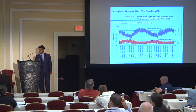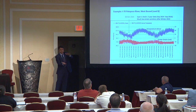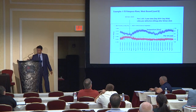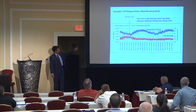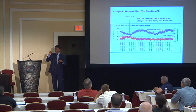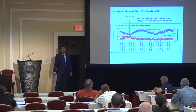Similarly, this graph shows strain — we see a lot of strain variation before that winter, and then strain started to subside, showing much less variation. And this is the pier: before that winter, the pier was deflecting back and forth thermally. After that winter, we see a pier that is quite flat. We still see those spikes caused by vibration from trucks passing over, but we no longer see the pier deflecting back and forth with temperature.